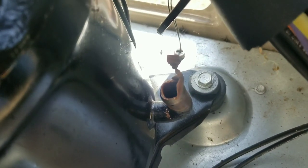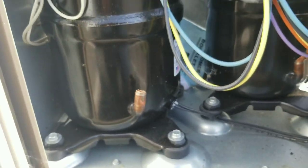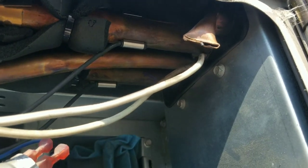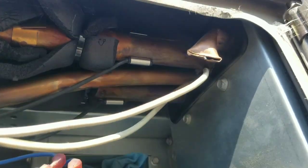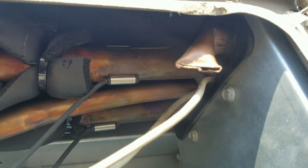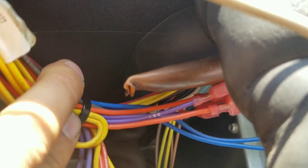They've been ripped off - not even a clean cut like with a hacksaw or sawzall. Coming up over here into our filter section, you can see the line coming off one of the compressors going into the condenser. We have two circuits on this unit. On that one they cut it and also bent it at a 90-degree angle, so we'll probably have to cut that back toward the condenser and run a new piece of pipe. The other circuit they cut but didn't damage it too much, so I can probably cut that back and connect a new piece.